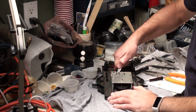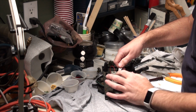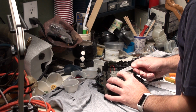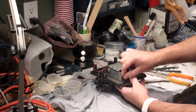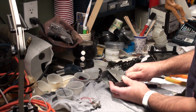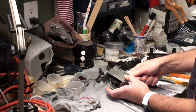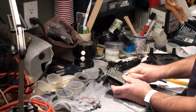This required careful, partial disassembly, as the motor had to be removed as well as all of the gears except the one that moved the tie rod. This was accomplished by first identifying the gears that needed to be removed, then removing the shafts of these gears that they rotated on. The steering box was separated from the front steering assembly by removing 2 self-tapping screws. The motor was removed first to free up the gears. Then the gear shafts were removed by carefully prying the metal lock fasteners on the shaft ends using the blade of a knife. Once pried off, the shafts could be removed and the gears just fell out of the assembly. The only gear to remain would be the one with the steering rod.